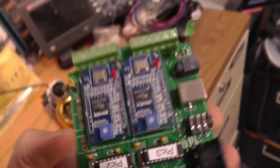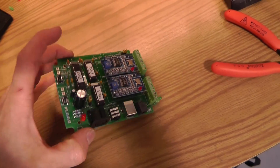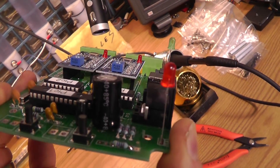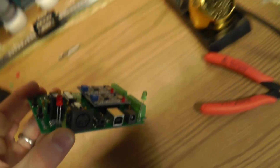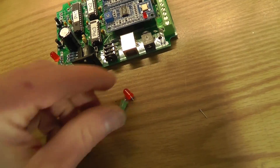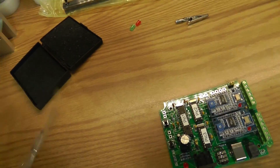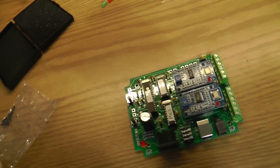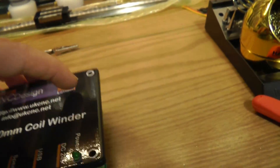The only real problem I had was getting these in the slots and the standoffs — the DIN rails. I put them in square but you can see they're slightly angled, so they're just a fraction off. That's not really a big deal. The only other thing: I originally put these two LEDs that they sent me in here and soldered them in, then realized they're supposed to be standing off so that when you put the lid on, they actually stand out of the box. So I had some LEDs and popped some new ones on there. I didn't read the instructions well enough.